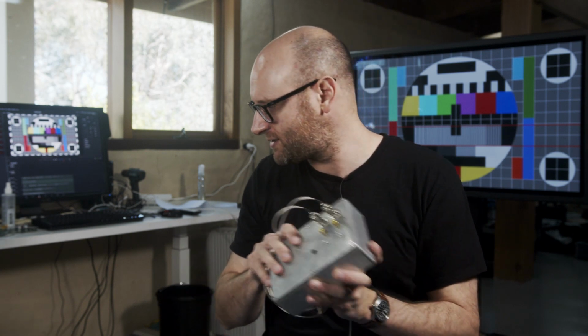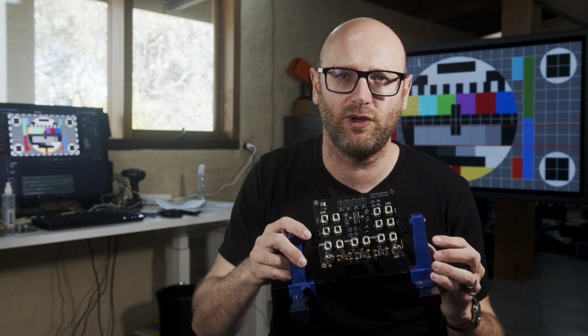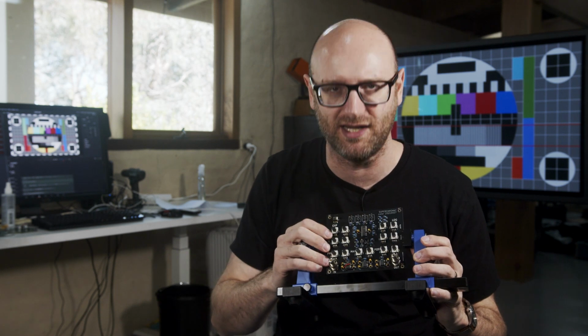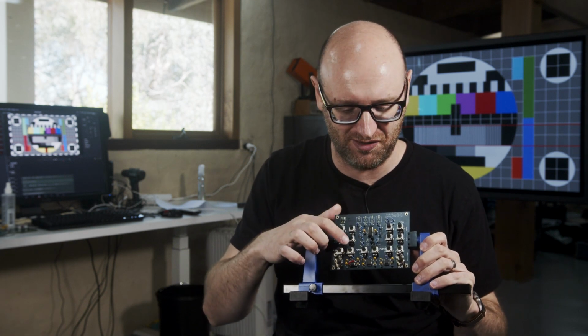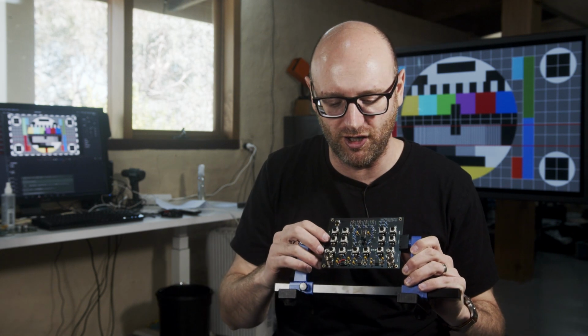And this is a cool little modular bit of gear that allows me to do other experiments. The next experiment I wanted to work on is this board here, which I'm still working on right now. I'll definitely cover this in my next video in detail. This is sort of, in air quotes, a color correction board. This is one channel. It has 14 knobs, 4 audio inputs, and it just takes one channel of component video and allows you to do a bunch of linear and non-linear transforms to the video signal. The heart of it is really doing log and exponential curves that allow you to do interesting things to contrast.